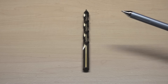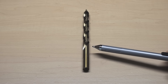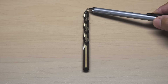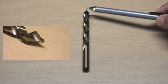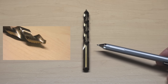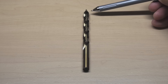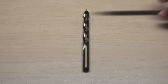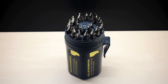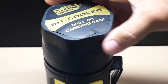The next brand is Drill America — a cobalt gold finish drill bit with a stepped point. It's a 135-degree split point, stepped all the way down. This bit was designed for drilling into hard materials such as hardened steel or stainless steel, so it will be interesting to see how well it performs with this new style tip. Average cost is around $13, and it's part of a 29-piece set in a waterproof container.